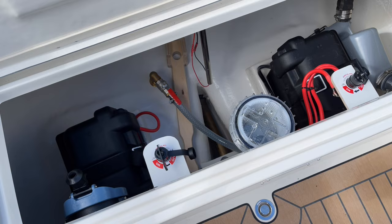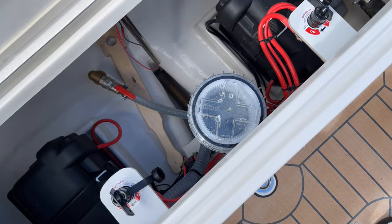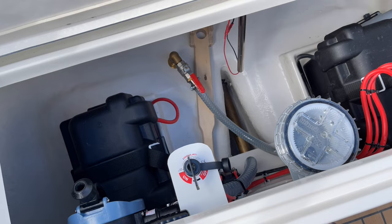You can always start the engine. There's a manual bilge pump. That is your weed filter — it strains out any debris from the raw water sucked in from the river to cool your engine. It's very easy to service, and when we hand the boat over to anybody we always run through that. Your main seacock is there, and the little wooden item at the bottom is an emergency rudder should you ever need it.